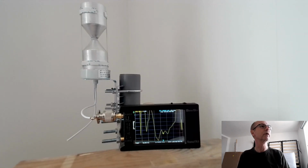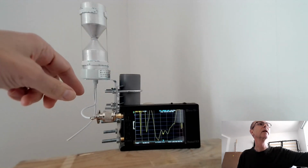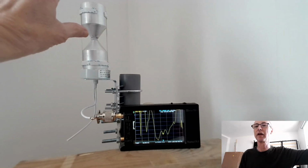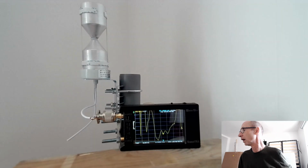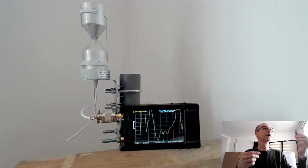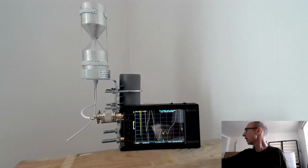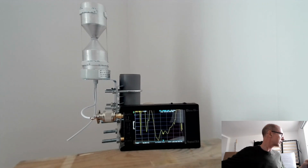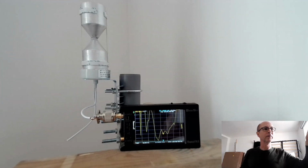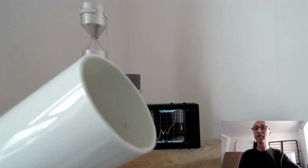What I wanted to do was, when I assumed it was two antennas in here, was to take one out, leave the one that works at 868 megahertz, and then put a little Meshtastic board like this one in there. Maybe a little Heltec would fit there with a battery to make a Meshtastic node that's completely self-contained. I've just thought of something, and that is, what happens if you put the radome, or whatever you want to call it, the plastic cover, back on the antenna?